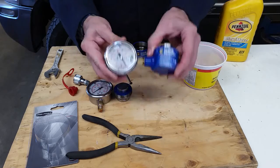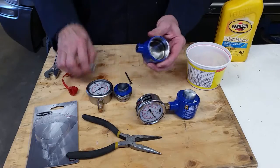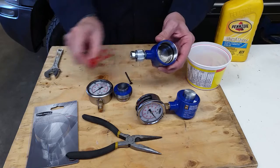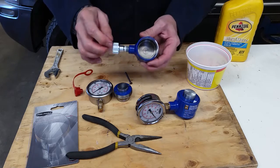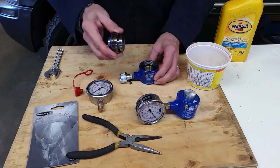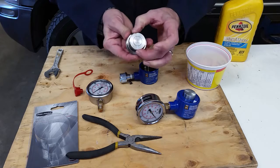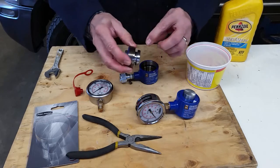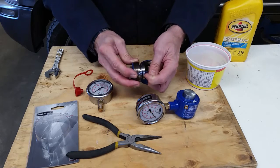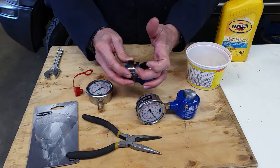So this is what it looks like finished. The ram itself comes assembled like this — you have a quick connect coupler inside with a plug. But this is what the bore looks like once it's taken apart. Now normally what you find when you're looking online, everybody says that you need to measure the outside diameter. But if you notice, this particular ram does not have an o-ring right here.